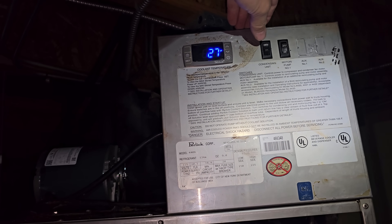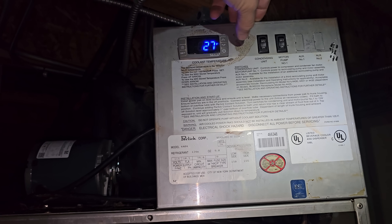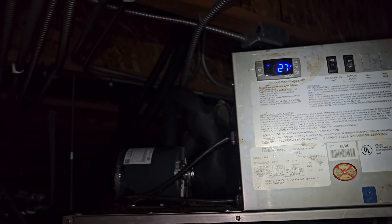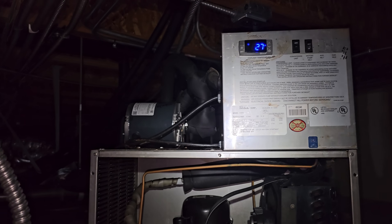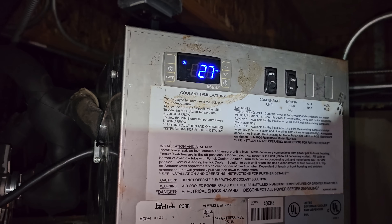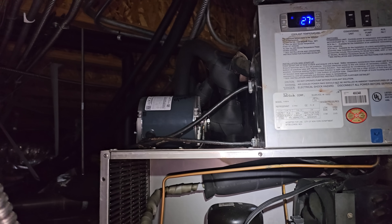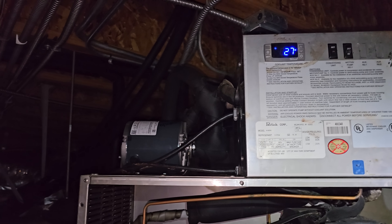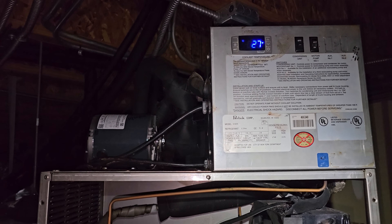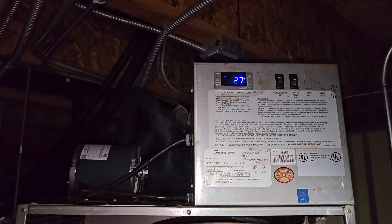The condensing unit switch — maybe it just interrupts the control power. I almost wonder if the technician simply shut off the wrong thing. The way these work is there's a glycol bath up in here with a heat exchanger in it, and the pump circulates fluid across that. This thing was running the compressor without running the pump, and you can't do that — it's basically just going to freeze up. You can actually rupture the heat exchanger. Why did he leave the pump off and the compressor on? I have a feeling he flipped the wrong dip switches.